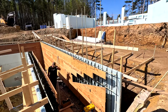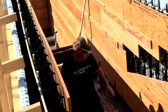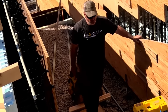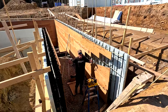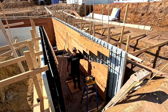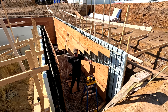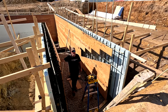Now, for the bottom angle, what do we put here? Underneath that area, where you're standing now, what will that be when it's all said and done? It's probably going to be all concrete. You can use the big geotechnical foam blocks if you had them. It looks like a lot of concrete, but you're talking about maybe 3 extra yards. So $500 and you're going to have that in the geotech foam. Trying to put gravel in here is going to push on the wall. It's a very robust set of stairs, but it actually ends up penciling out to be as cheap as anything.